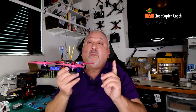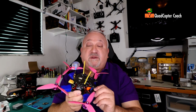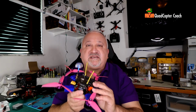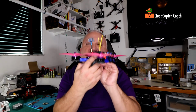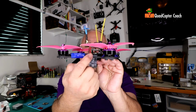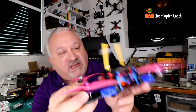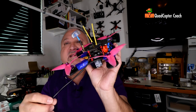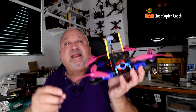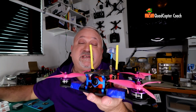I hope you stayed to the end of the story because now you got to see how this came to be. This came out much better than I expected. By not using the MotoLab board and using the Lumenier Lux V2 board, well, that was so easy to set up. It was a really nice board. The only funny part was, well, over here, the USB port. I don't know if you can see that. There's a standoff that's kind of in the way, but using this red fluted one, well, now I can take a USB cable like this and push the rubber standoffs just slightly, and then look at that. I can get the USB cable in and program the flight controller. And I couldn't do that without changing out the standoffs. So that was the only surprise here.